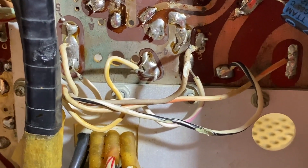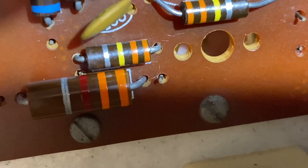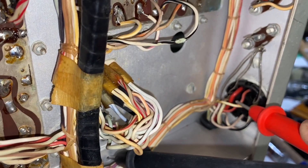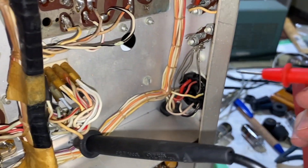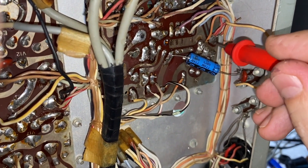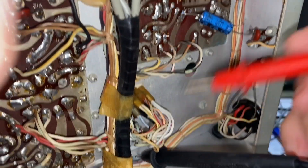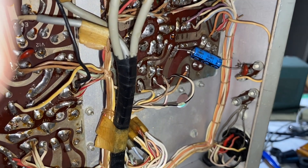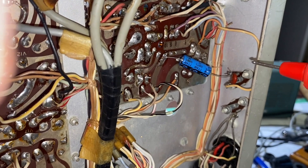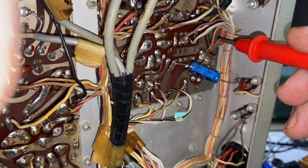I would say most of the time the problem is something mechanical, like a bad solder connection. And right here, see how the wire is moving in place? Not good — I'm going to re-solder that. This pink wire — it should be red, but it's an old rig so it's faded. This is where it comes in from the power supply with 320-odd volts, and it goes up to the voltage regulator tube, OA2. But I'm grounded to chassis here, and something's wrong — it's shorting. Let's follow the schematic and find out what I did wrong, because it wasn't doing that before.